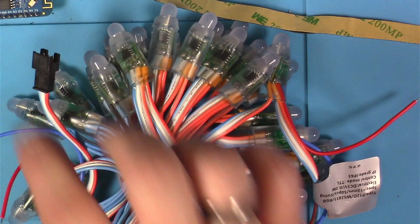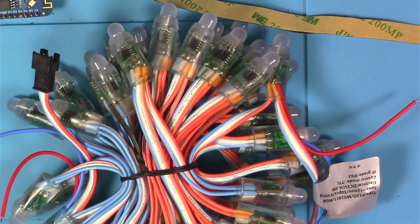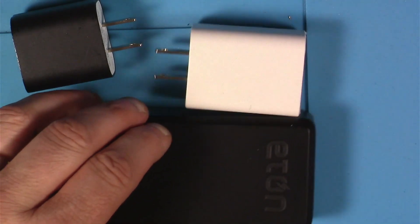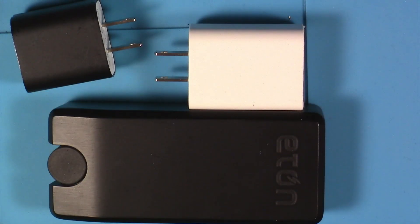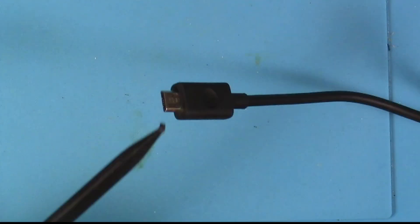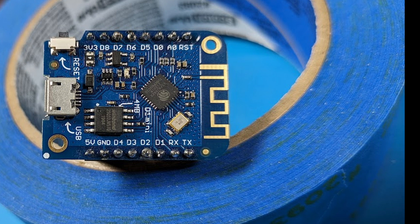To keep things simple, we're going to stick with five volt strips for this exercise. We don't want overly long strips or to link multiple ones together. We'll be drawing our five volts from the board itself via its USB connection, so we don't want to draw too much current. To power your board and lights you can use USB power from a PC, AC adapters, or a normal USB power brick - useful if you want something remote like a wreath outside. You'll need a USB cable matching your controller type, either micro USB or USB-C.